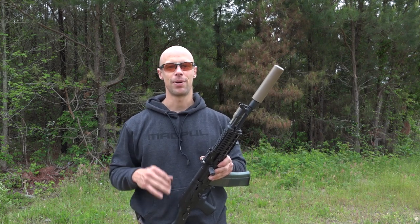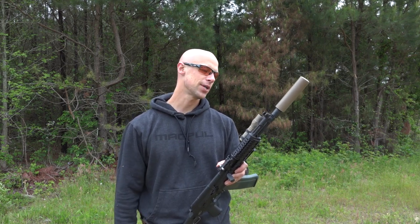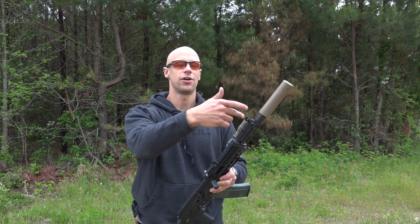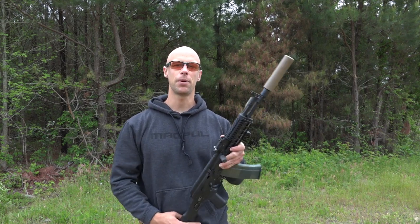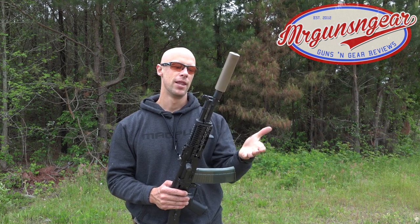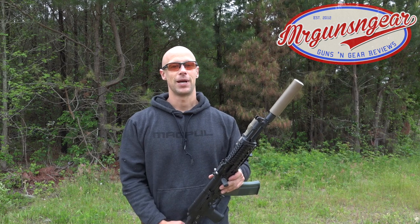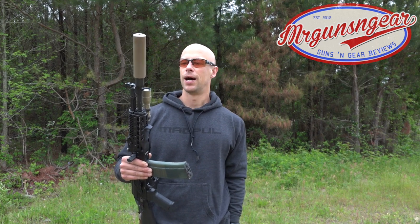The easiest way, though, and probably the most accurate way for most folks outside of putting your barrel in a lathe and running it to see if it's concentric, is to actually remove your bolt carrier group completely, top cover, all that stuff, and look through the suppressor with a bright light behind the chamber there. That will let you know more than anything that I've seen definitively if the actual threads are concentric to the bore. So that is definitely something you want to look at more than anything. So you want to check that out. If it's not, just kind of give up, guys. I don't know what else to tell you. Don't do it. It's not worth risking a baffle strike and ruining your suppressor that you waited months for and paid a lot of money for. So I recommend not doing that.